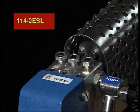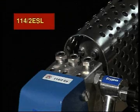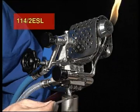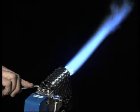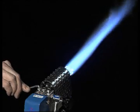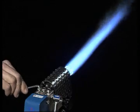On the top side are the adjusting screws for regulating the oxygen flow for the pinpoint flame, the medium flame, and the intense flame. Underneath are the valve screws for controlling the gas flow for the pinpoint flame, the medium flame, and the intense flame. Turning the valve screw clockwise reduces the oxygen flow — the lack of oxygen causes a bright gas core. Turning the valve screw anti-clockwise generates a surplus of oxygen, which causes flame turbulence and cold areas.